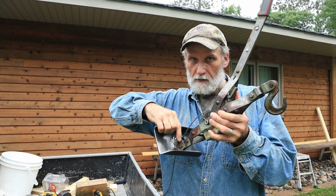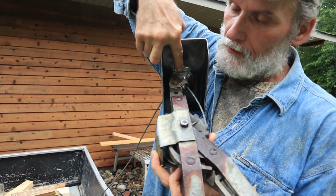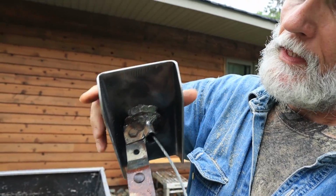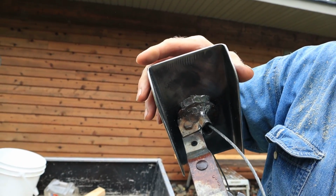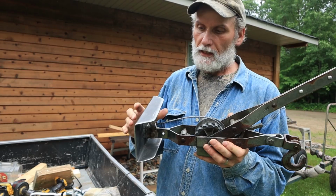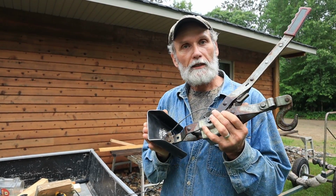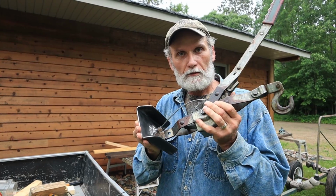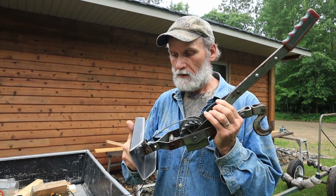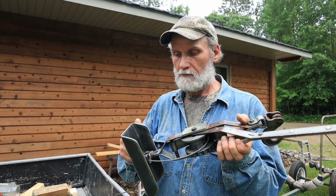And it has a little, if you can see right here, the little bracket thing that I welded onto the end. It was a washer, a thick washer, and then this piece of 2x4 steel tubing is the 1/8 inch wall steel tubing that I just cut to weld to it to give me enough of a surface so it didn't waddle around or tip over. Okay, but very simple. About an hour to fit this on and clean it up so it's nice.